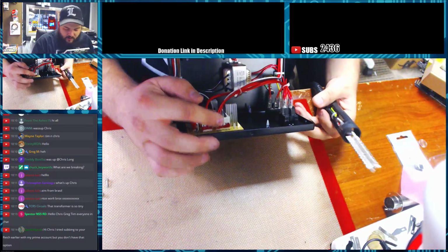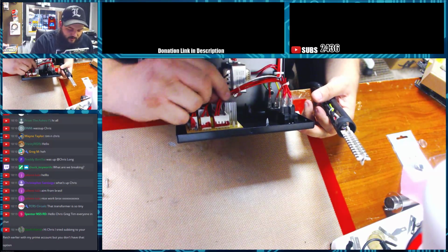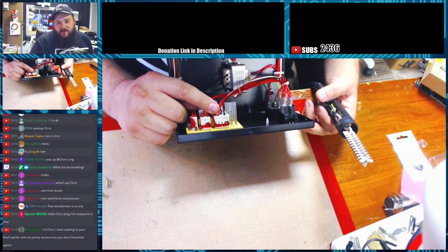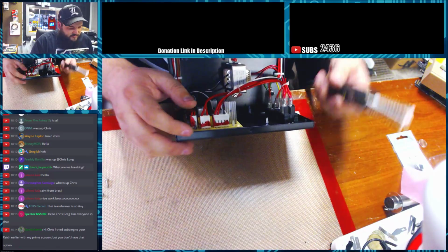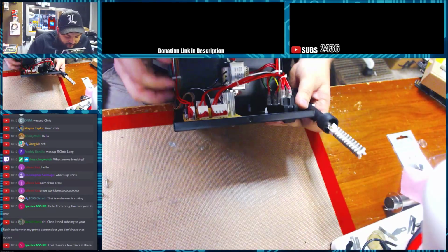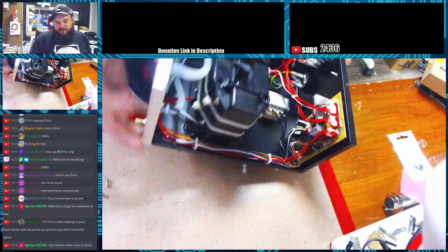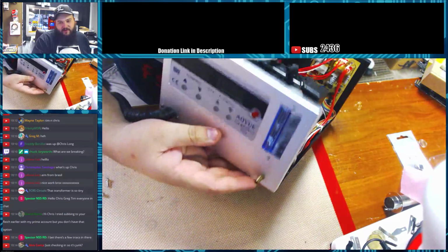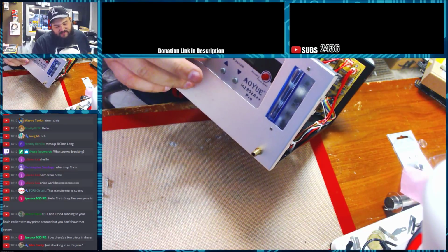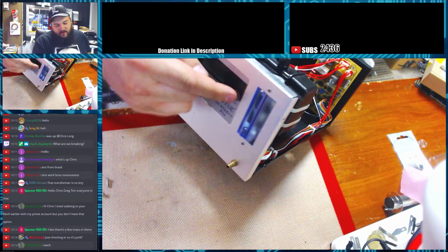Yeah, it has the wand and the temperature sensor wires coming back into this board here. So the 2 red wires are the heating element feeds, and the black and the white wire are actually the K-type temperature probe sensor that sits in the actual head here. Then from there, it's got this control cable that runs up the side here, goes to the front panel. The front panel has all analog buttons. Everything is analog. It's got a digital readout, and you've got an on-off switch.